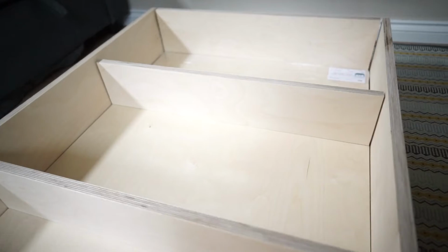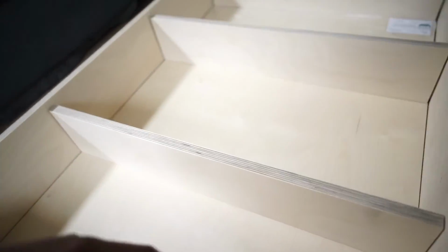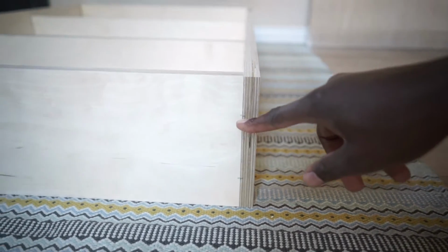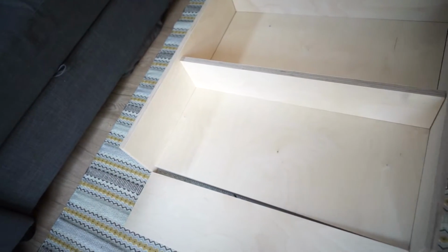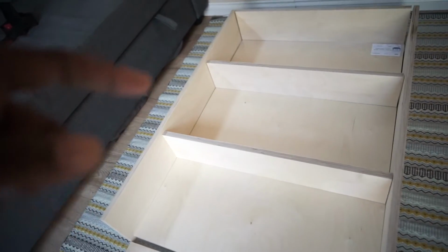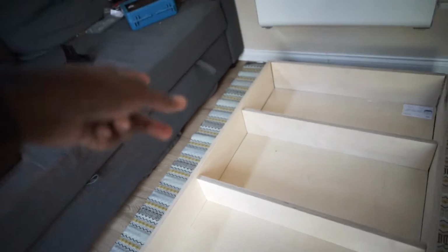So what I need to do is work out where my dowels are going to go in the jig, so I'm going to start doing some markings. What I'll do is I'll remove the center bits and do the outside first. We want it to fit nice and flush to the corners like so. And I've put a mark across the backboard, a quick line in two places there and then two places there. Then I'll get my square. I can then put a straight line across the inside there, and across the inside there, which then means I can start drilling in with my jig. But before I do that, I'll need to measure, make sure I get the middles, and then start doing that on all corners.